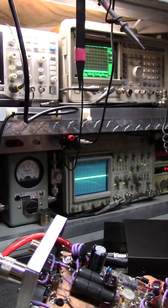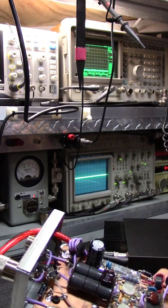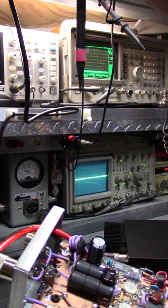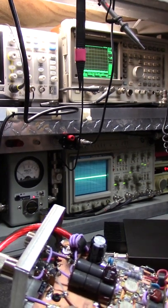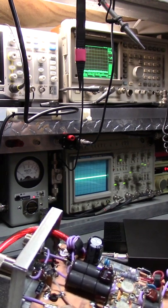So we're going to check it real quick with a half wavelength tuned coax. We're going to check it with 32 inch, just because that's what it was, 32 inch, on the antenna and off the antenna with this. And then hopefully, it goes into self-oscillation. Alright.